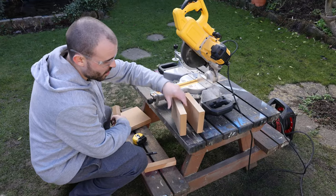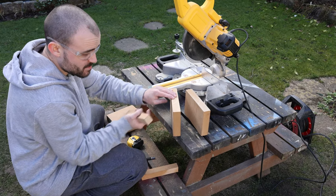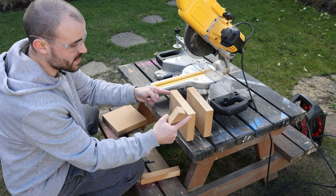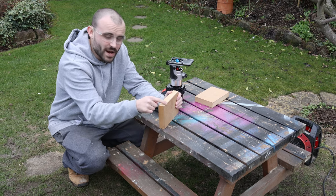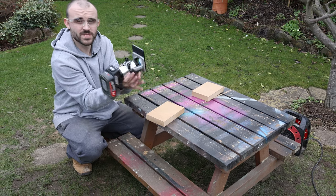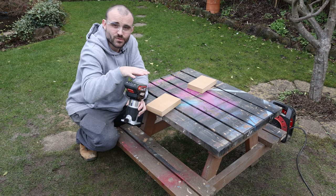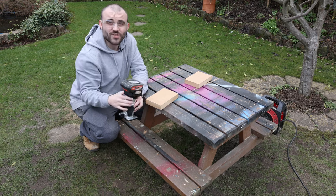I've made a bit of an adjustment — I originally cut them to 18 centimeters deep and 15 centimeters high, but they looked a bit too tall, so I've cut a bit off the top and made them 12 centimeters high by 18 centimeters deep. These side pieces are okay as they are, but I want to add a nice round profile to the front, so I'm going to use a round-over bit with this 18-volt palm router that Trend very kindly sent me — not a sponsored video, but I'll leave a link in the description.